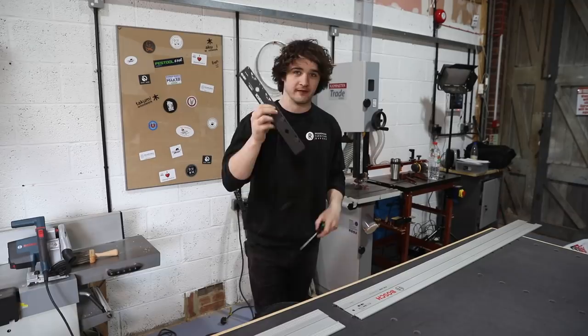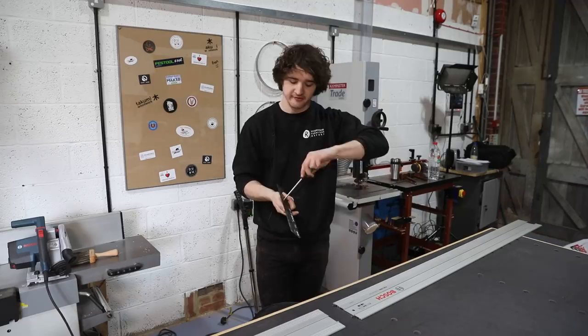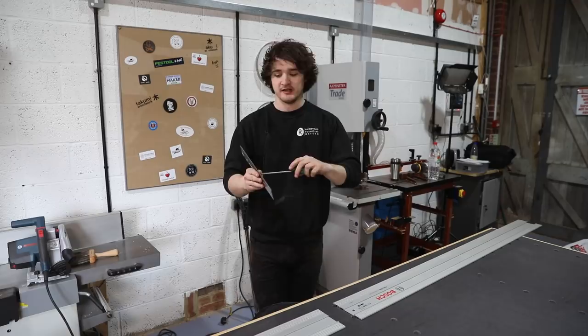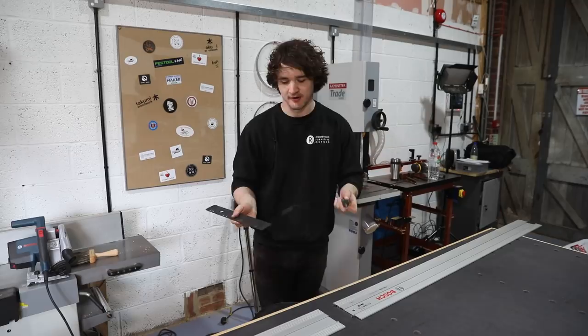The fact that this locks sideways and ensures a perfectly straight line means that your cut at 3.2 metres long is going to be perfectly straight. The other thing I like is that when you tighten those cam locks, it's not tightening the actual screw against the side of the aluminium guide rail — it's got a little protective block that prevents any wear or damage to your rail. With other systems using grub screws, tightening into aluminium long term is going to start chewing up the guide rail.